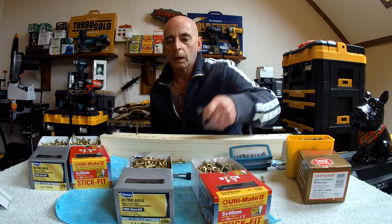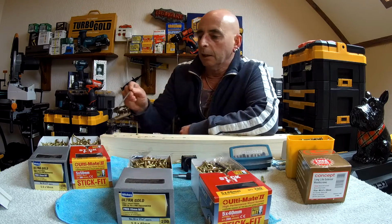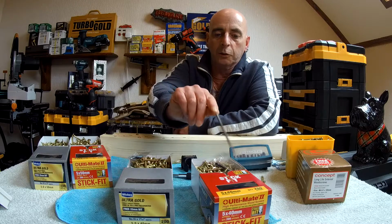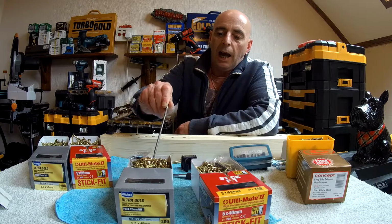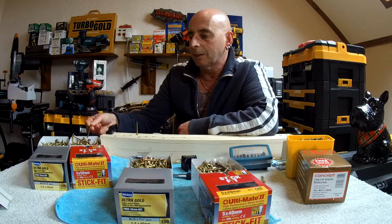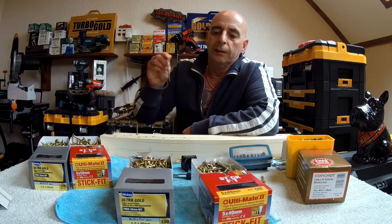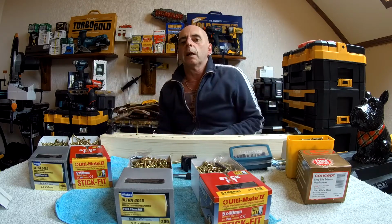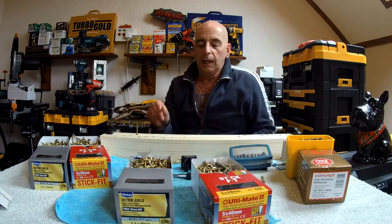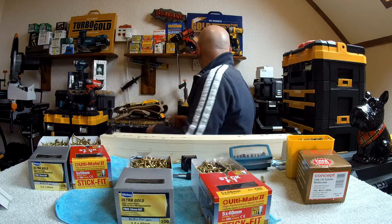Right, switch that off. So, I know I didn't actually show these without the countersink head, but basically speaking, you're paying a lot of money, and then you find, and I did check this at Screwfix, I did look at their range, that the double countersink head with ribs on it usually starts at the 4x50s and the 5x50s. These ones under that range don't have the countersink head, and you really do need that countersink head if you're putting the screws in and you want them to be perfect.